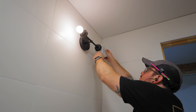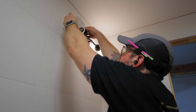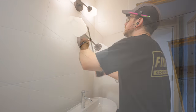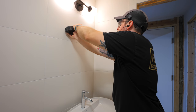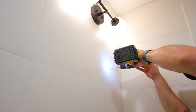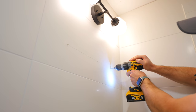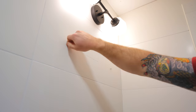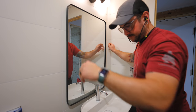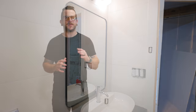I had installed the vanity light earlier in the bathroom project just so we could have a little more light in there, but I held off on adding the glass shades until now since I didn't want to accidentally break them during the tiling process. Next I got the vanity mirror installed, which meant more holes in my new tile, but thankfully it was pretty simple after some quick layout work. I used wall anchors to hang the mirror — these supposedly hold 50 pounds each in drywall, which is plenty for this mirror. When laying out the mirror height, I centered it between the vanity countertop and the light fixture, though in retrospect I'm thinking I might should have centered it between the top of the sink and the fixture.